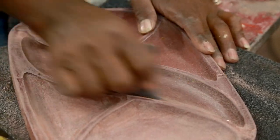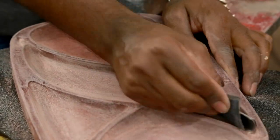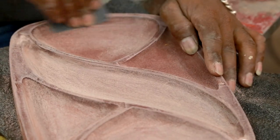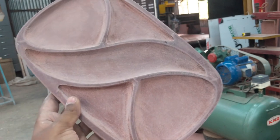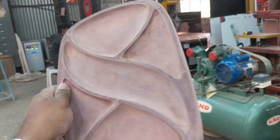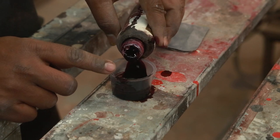After the epoxy has dried up it almost looks like pure MDF, but when you sand it gives a white dust — and that's how well this epoxy sands. I really like that. I go ahead and sand up to 400 grit after sanding the entire piece. This is how it actually looks — you can see the entire MDF has become white in color because we have sanded all the surface including the back. Now we can go ahead and stain.